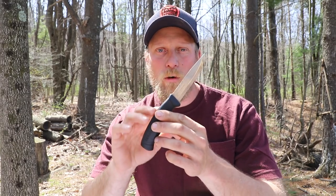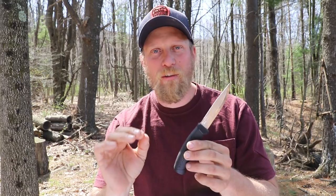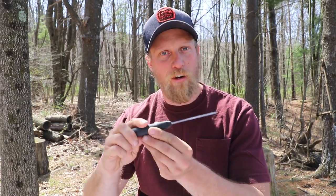To take something like this Mora Companion and make it a little bit better by adding that 90-degree spine to it, there are two different methods. First, if somebody you know has a belt grinder, let them do it. It's so easy, it's so quick, it's so effective. Don't look at it as much as a wilderness skill — it's more about prepping your gear for the wilderness. There's no cheating if you put it on that belt grinder. You don't want to use a wheel grinder though, because the wheel has a bevel to it and it's not going to get a nice sharp spine. So just scratch that idea.